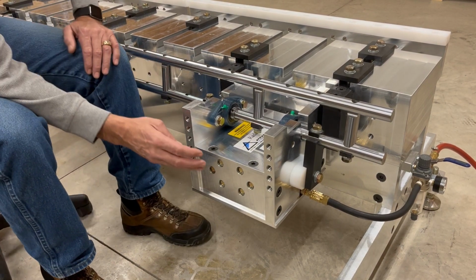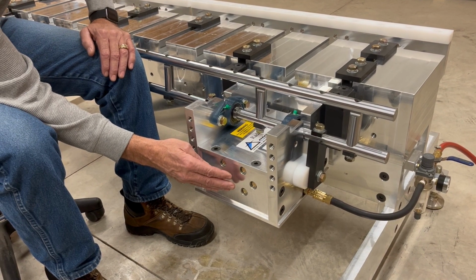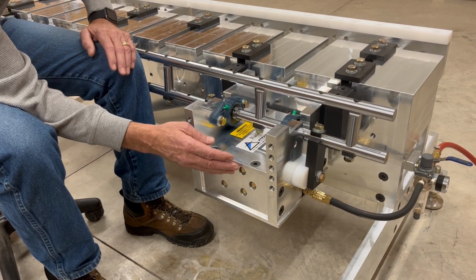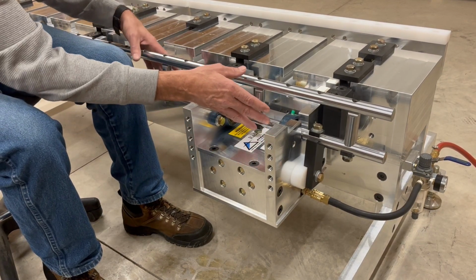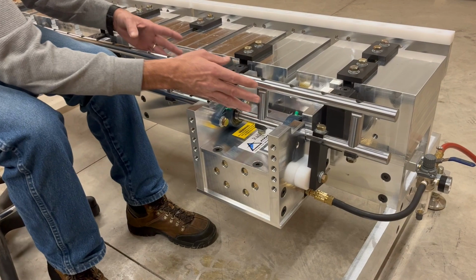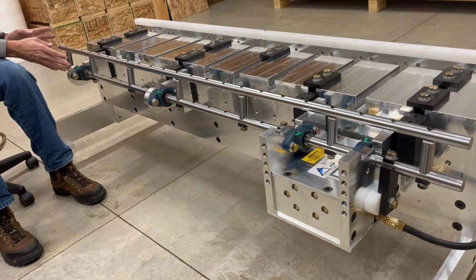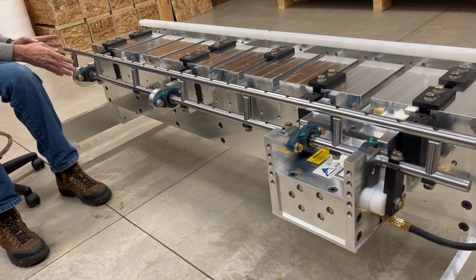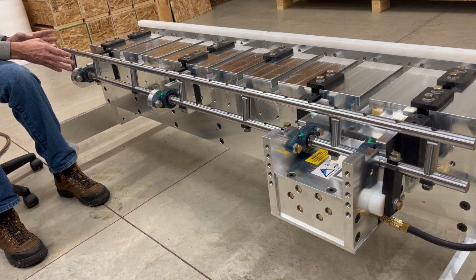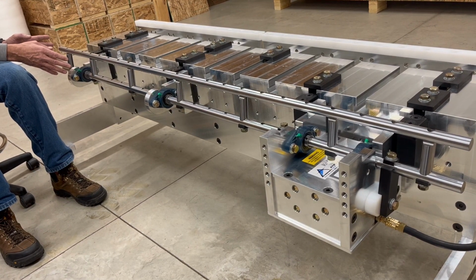So now this 350 pounds of push force translates into the ability of this shaker drive to handle pivot rack assemblies up to 6 foot long, which means that you can use this Radial Pro-LD system on press beds with bolsters up to 6 foot wide.